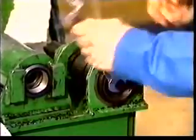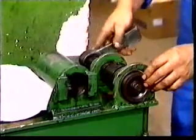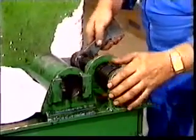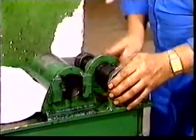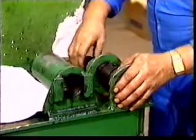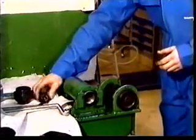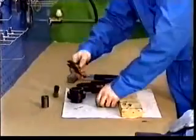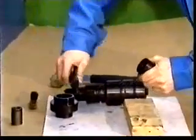Release the nozzle spring tension by opening the counter nut and screwing up the adjusting screw. Remove the nozzle from the holder by opening the nozzle nut. Take care with the fixing pins. Remove the needle from the nozzle. If the needle is sticking, do not use force, because this often results in complete jamming.